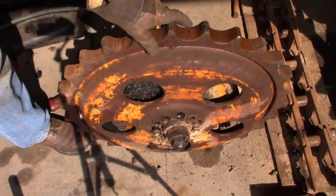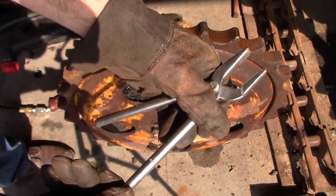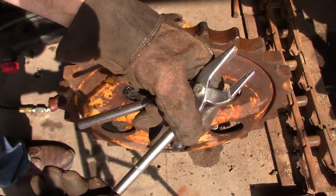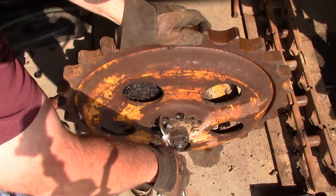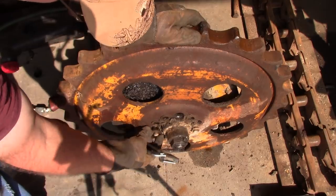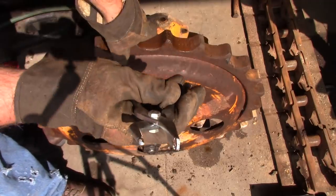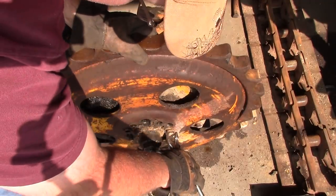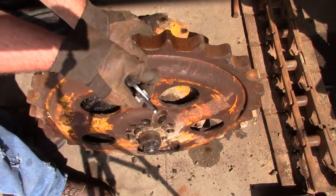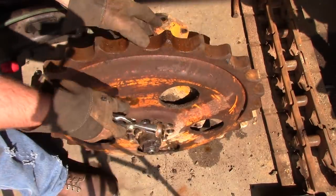There you go. There's actually a special pair of pliers to deal with these cone-shaped washers or spacers, whatever you want to call them. It's an OTC 7077. I've had these forever, because like I said, a lot of older truck axles use this same setup. So that one comes out easily. It has a little wedge. The wedge goes in the split, and then it expands the spacer as you pull it off. There we go.